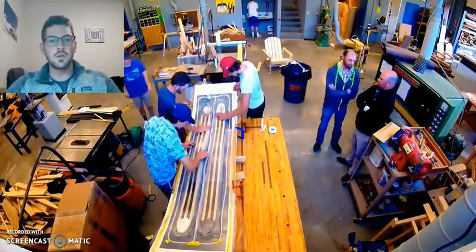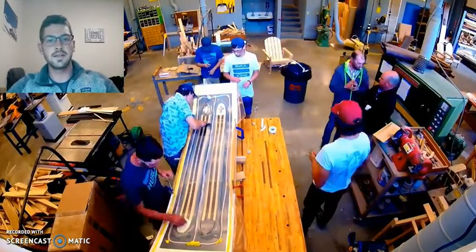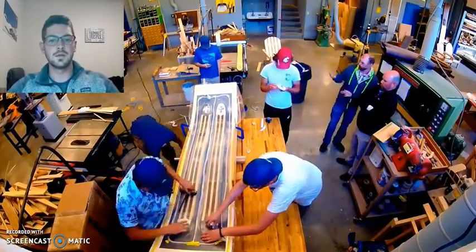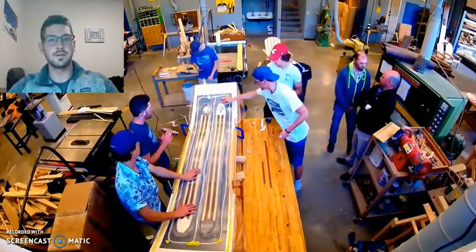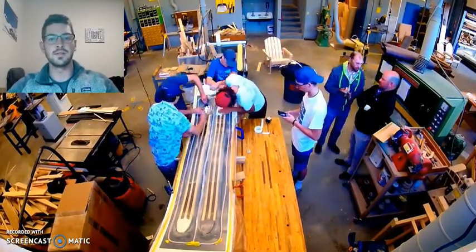Once we've pushed all the air out, we turn on a fan to our pump so that we don't have any heating issues, and we continue to monitor for any leaks, because if we have a leak in air pressure, we're not going to get the desired amount of vacuum, and that will create a weakness in the press.